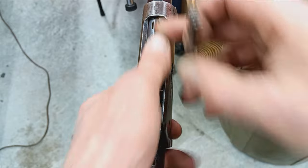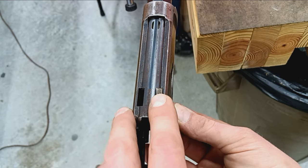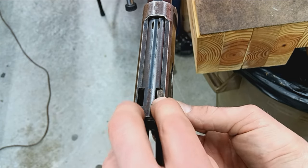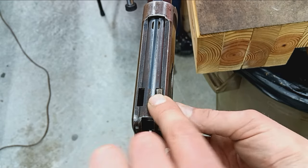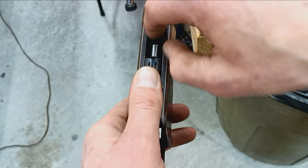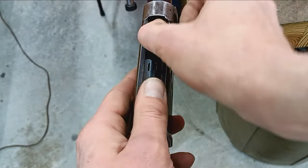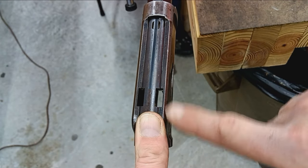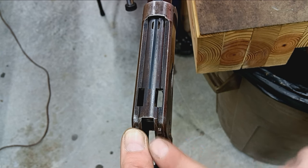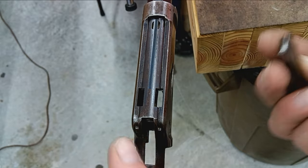So one way, you close it, and then you feed one of the two locking blocks up. And as long as, you can see this one's loose or free. So that's what you want to see on a go gauge. And then conversely, with a no-go, I'm going to close it. Sometimes you can actually visually see, like on the back here, that the bolt isn't flush with the frame. So that's telling you this isn't closed all the way.